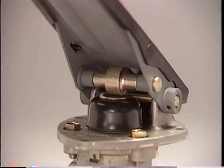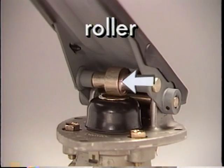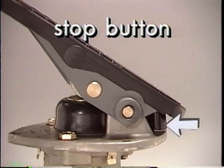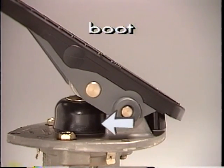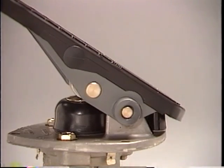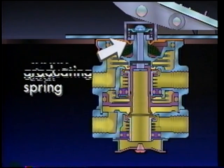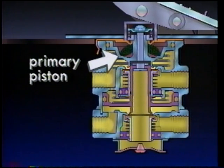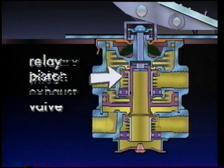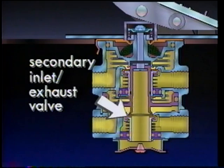The actuation components of the E6 — pedal or treadle, plunger, roller, stop button, boot, and fulcrum pin — are interchangeable with other brake valves. The internal components are spring seat, graduating spring, primary piston, primary inlet and exhaust valves, secondary or relay piston, and secondary inlet and exhaust valves.